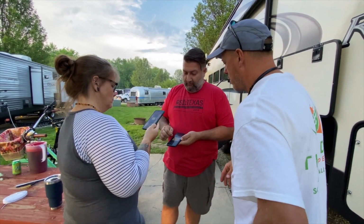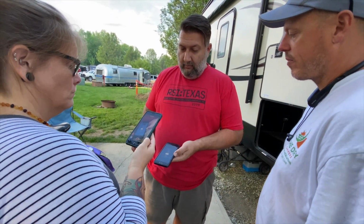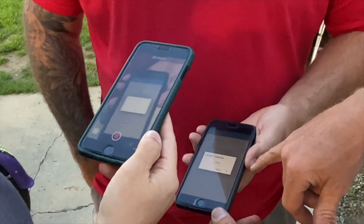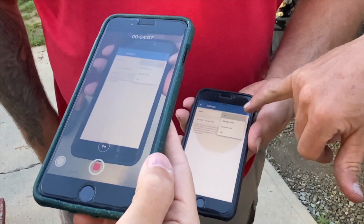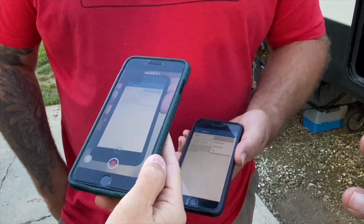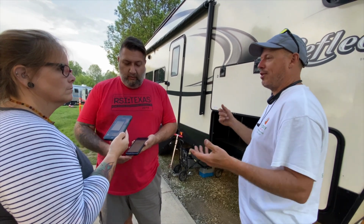Then this goes back to 50, because you're on 50, and then tell it okay. Now if you click the gear wheel, this takes you into another way to change the 50 amp to a different number, whatever you want. Cancel. And if you go right here, this is a drop down. Inverter on means it'll charge and or invert, but you can set it to charger only, inverter only, or you can literally just shut it off from the app. So if you're boondocking somewhere and don't need the power, just shut it off.